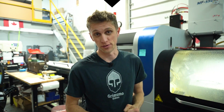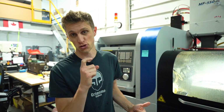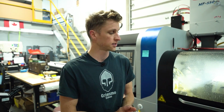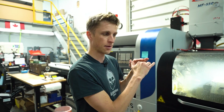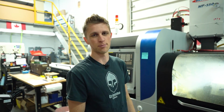I have really good news. So yesterday I was whining about that problem with the Swiss making short parts. Put up that post on Instagram, got tons and tons of great, awesome feedback. Some really solid leads. Eventually it was my buddy Rick Check that said run the machine in single block, where it runs through one line of code at a time and pauses, and then you'll see exactly where the problem is. And when I did that, it was painfully obvious that I made a mistake.